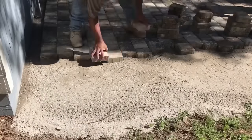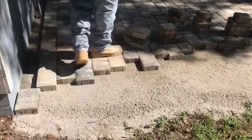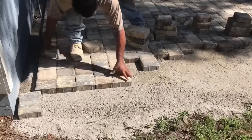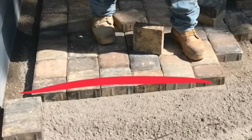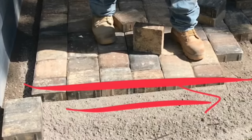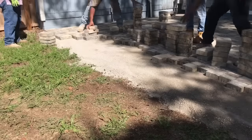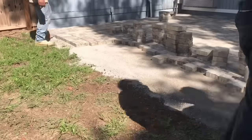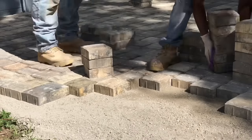Let me try to explain this visually as they are laying the pavers to the very end of the patio. They're taking a few out and moving some around — and watch: one, two, three, four, five — you see that straight line right there? That line is going to repeat itself all the way down, a hundred feet, no matter what, because these three measurements always work out that way. What an engineering feat this is. I didn't realize this was how they did it, but I guess it's commonplace knowledge if you do it every day.